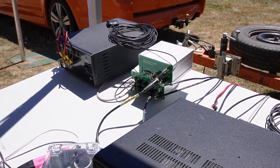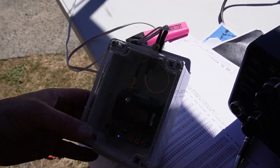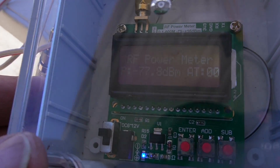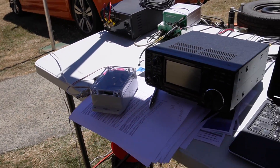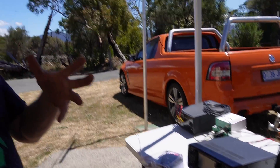What about this little box? It's a little eBay RF power meter. I use that to hook it up to the IF and it measures the RF coming out of the transverter. I can peak up sun noise — I get about 12 dB of sun noise on this dish. I can peak that up and then make sure that the rifle scope is aligned to the sun, so the rifle scope is calibrated to where the dish is pointing.